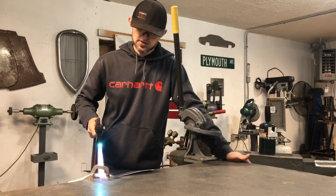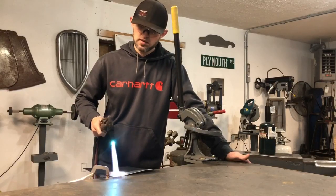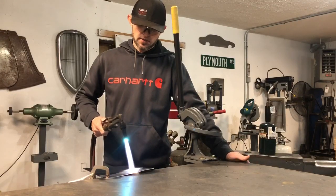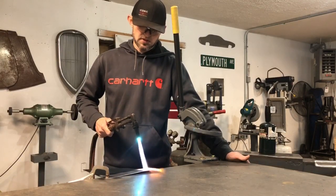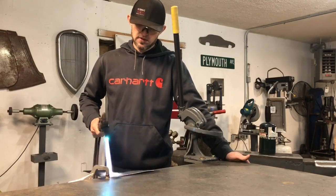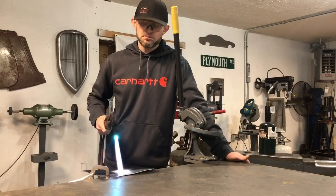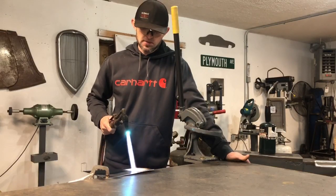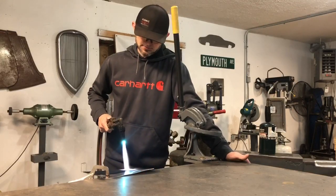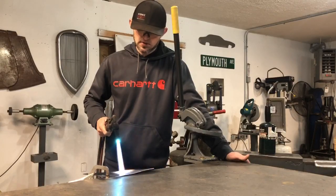It's starting to lift right now because it's just clamped down, but you can see it's already starting to remove the soot. What's happening is it's taking it to the point of right before it melts. This works with any aluminum — I did an exhaust plate for an Eco-Bird out of quarter-inch plate, same difference. So if you're having a hard time beating the crap out of it with a hammer and a beating bag and you want to make it softer, this is the trick.